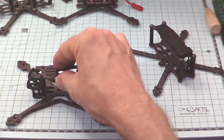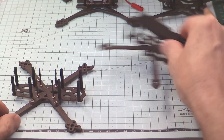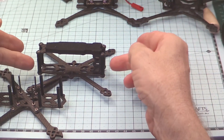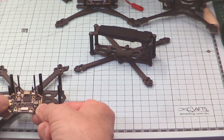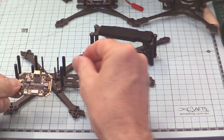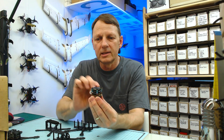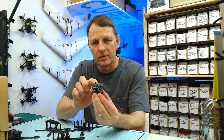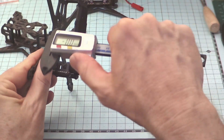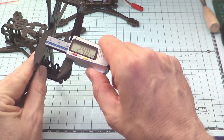If we have a look at another frame — here's another frame — opposed to having just four standoffs, this one's actually got eight standoffs. And of course we can see there's absolutely no way that an all-in-one board is going to fit in that frame. So for a lot of frames out there, we can see that there's actually no choice — you really just have to build a stack like this, with your ESC on the bottom and the flight controller, and what I've got here is a naked Vista unit on top. A lot of frames on the market have got 25mm standoffs, which gives us plenty of room to work with a stack.